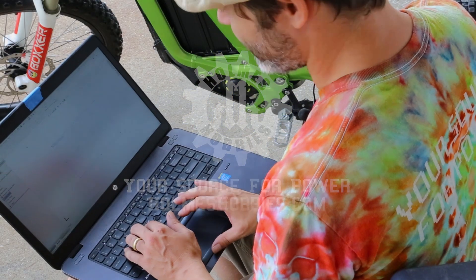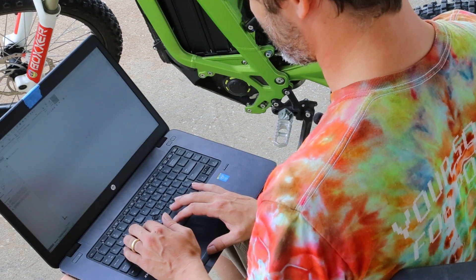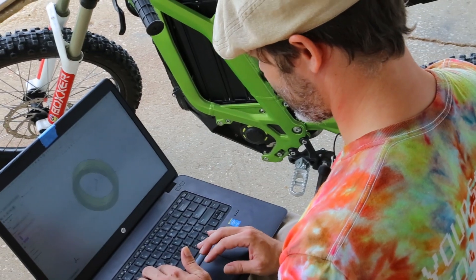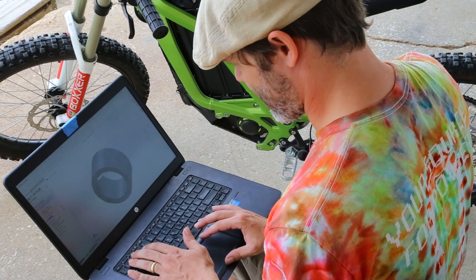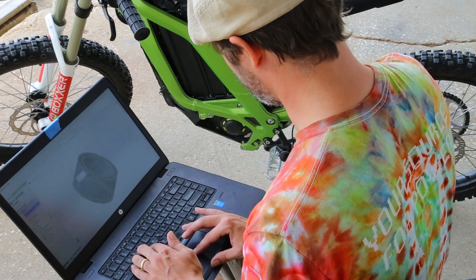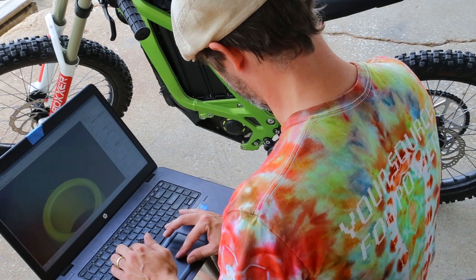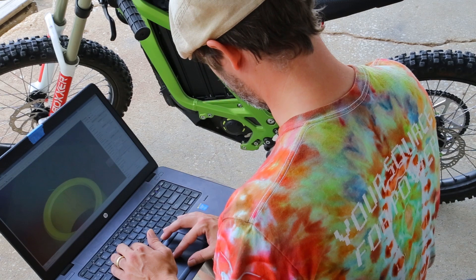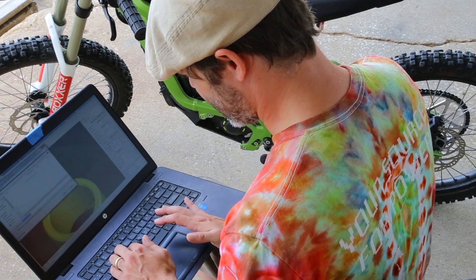Next up we're going to design the part in Solidworks — I'm using a copy of 2016. I'm going to do this a simple way: instead of a round revolved extrusion, I'm going to do a 32 millimeter ID and actually undersize the inside by just a little bit. Height set to about an inch, so 25 millimeters. We'll go with about a one millimeter chamfer on each side and also one on the bottom, just so it looks fabulous. That's basically our part — it looks like a bushing, which is essentially what it is. I'm going to start with 25% fill density since this just needs to be crushed anyway, and three perimeters so it has a little more heft. Now we can export the G-code into the folder and upload it to the printer.